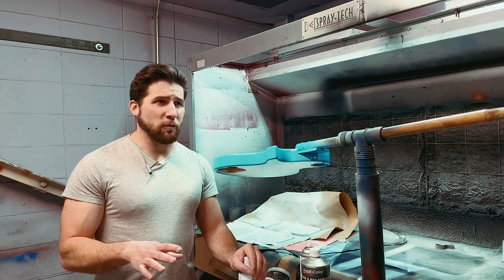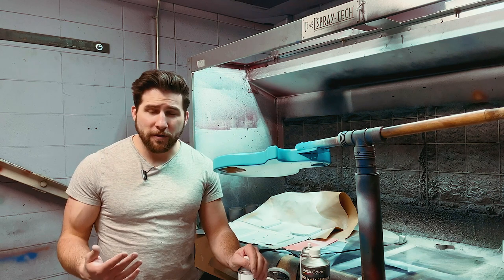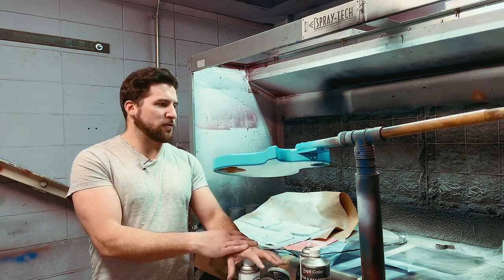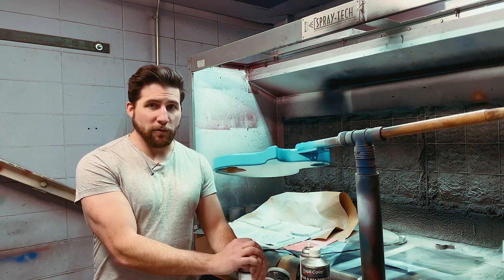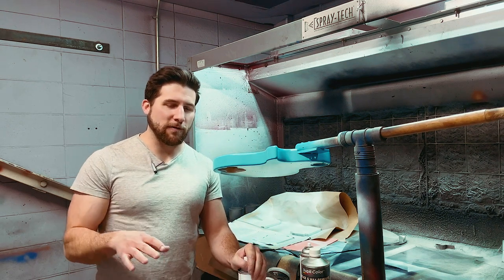Now there are actually a lot of different ways to get a satin finish. You can do a rub-on satin finish. A lot of oils finish out at around satin — the same degree of sheen is available in a lot of different finishes. But one of the more difficult ones is spraying satin finishes, and that's what I get a lot of questions about.